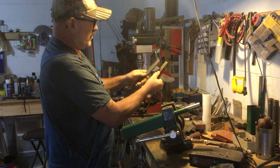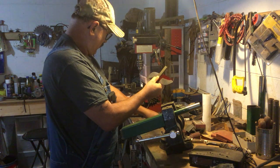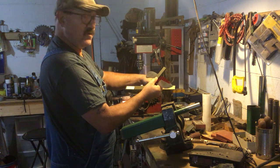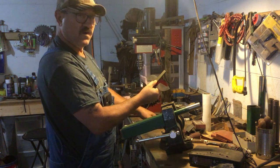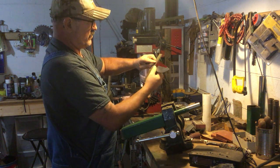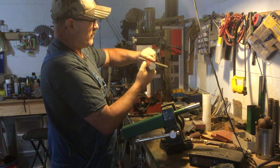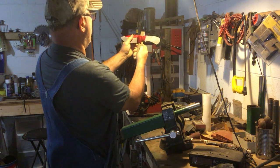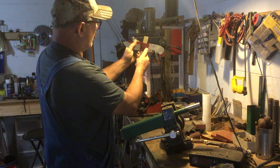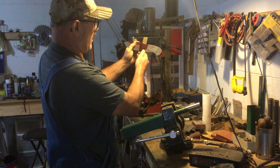What I'm going to do now is lay out the front bolster. This nickel silver — this is NS 752 nickel — it's really, really good stuff. I'll lay out the front bolster, get the angle that I want, make sure I have enough forward travel so that it doesn't interfere with my handle in the middle, but yet doesn't overrun out into the blade. There's a sweet spot right there I will find.